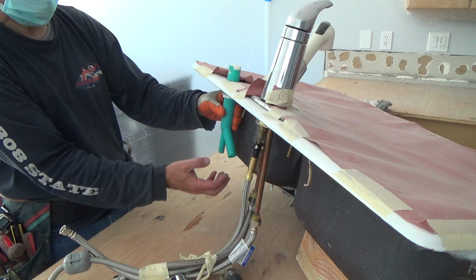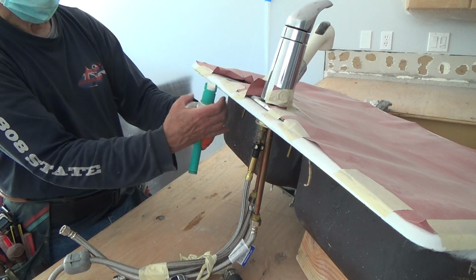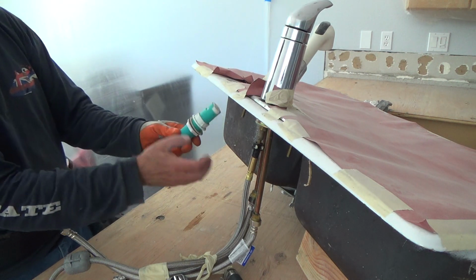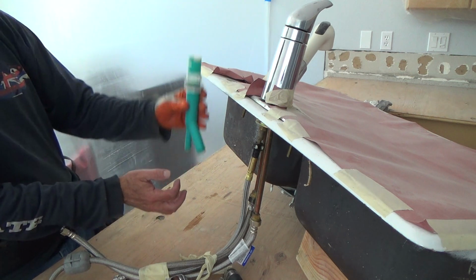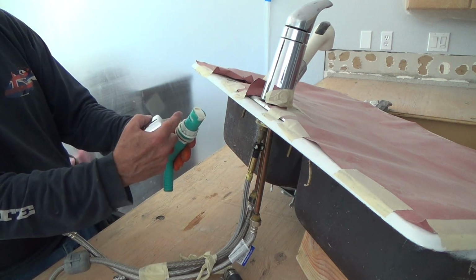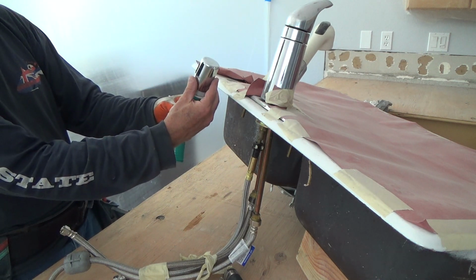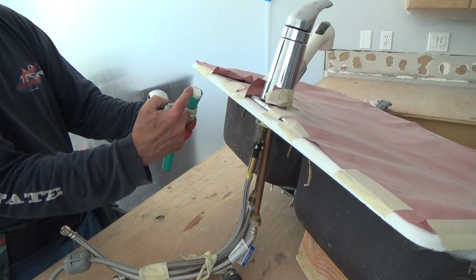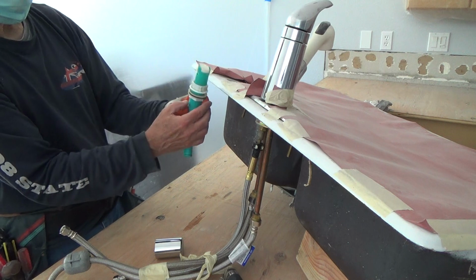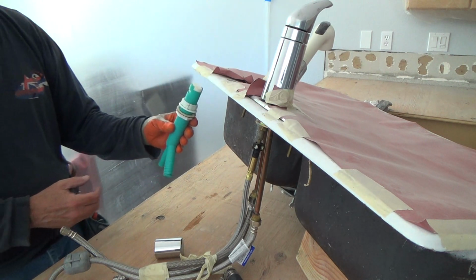Then push everything up. You know, you push it up, have somebody else with the nut, and they can tighten it up. Before you do anything, you want to adjust the bottom nut so that you know how high to push it up so that you can put your cap on. Sometimes it might be too low. Okay, I've got to raise it up. Oh shoot, now I pop it on and it doesn't go down all the way because it's hitting up here. You can't tighten that down anymore without going underneath the sink, loosening that one, boop, boop, boop, boop, boop, and then tightening this one. Do you see what I mean?